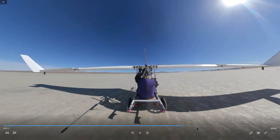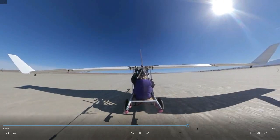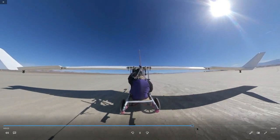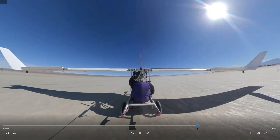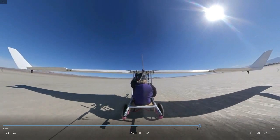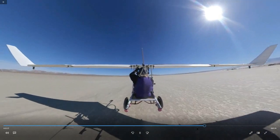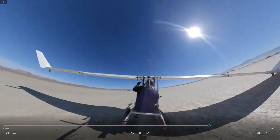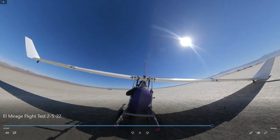This is the same run, just a different view where you can see the 2 elevons, and you see I lift the nose off, it just pops into the air here shortly. It just jumps off the ground. I'm holding for that elevator. You hit a high speed, and boom, I'm off the ground. Get off the elevator, back down to neutral, and I'm actually holding about half forward stick when I pulled the release. And the problem was when I pulled the release, it pitched up even more.